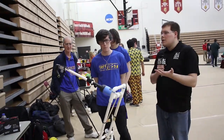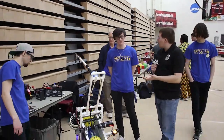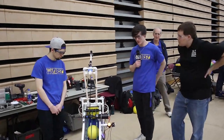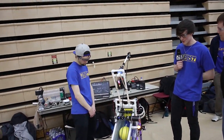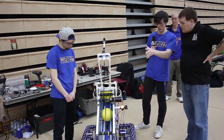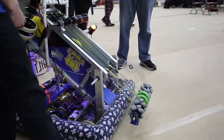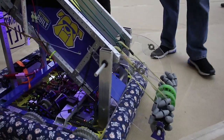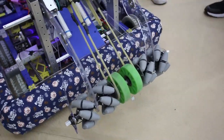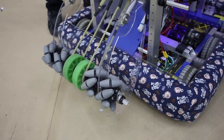What are some of the challenges you've had as you built this robot? Nothing ever goes quite as planned — what's some of the stuff you've had to worry about? There are a lot of problems that come along with things that aren't positively controlled. Our intake kind of just falls down to a set point when we start the match, and that's the only way of getting it down to collect power cells. This has brought up problems with it being off-center, not level, and not being able to collect the power cells because of its variability in falling down.